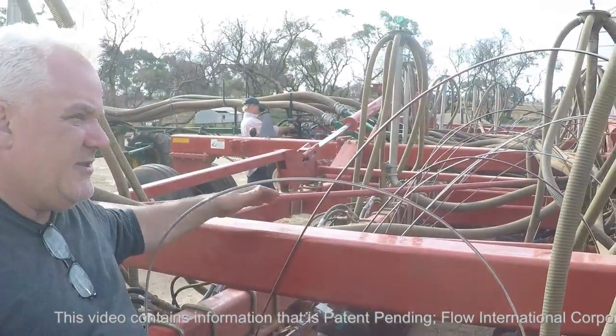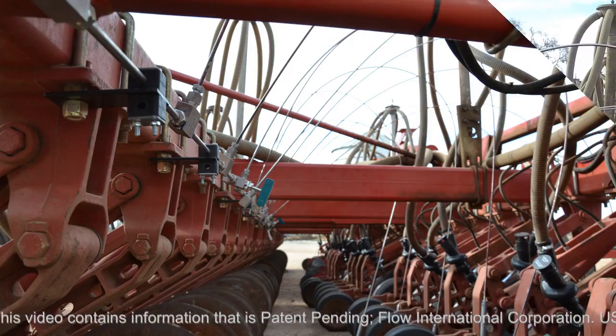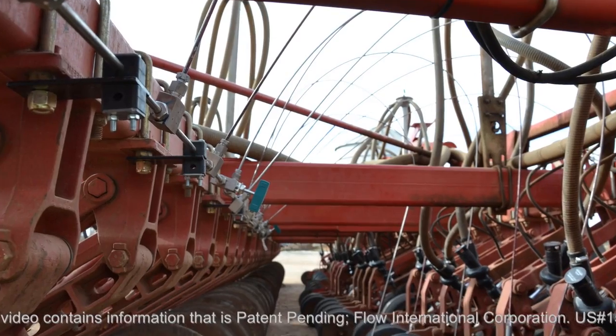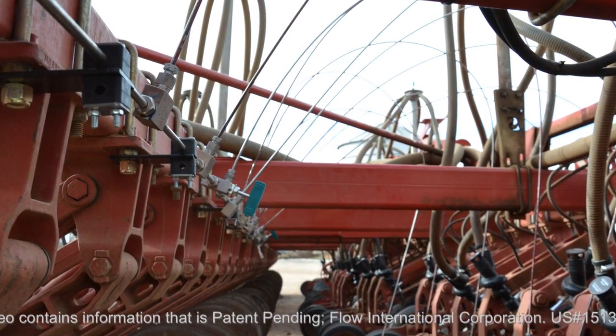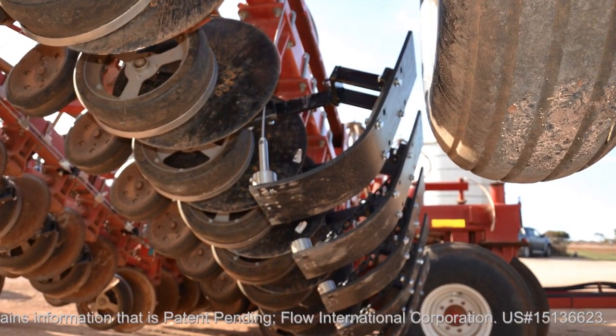It's done so we can isolate specific nozzles in specific areas to run different trials. The water goes through the tubing to a water jet cutting nozzle which has got a jewelled orifice — a sapphire orifice — somewhere between 6 and 10 thou.